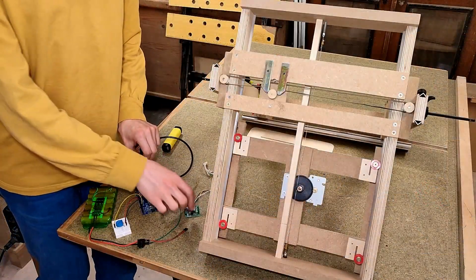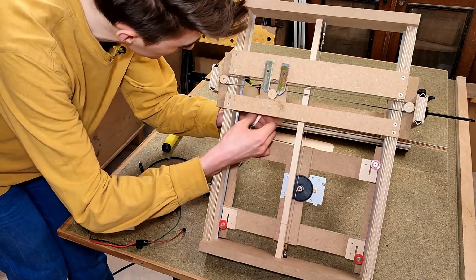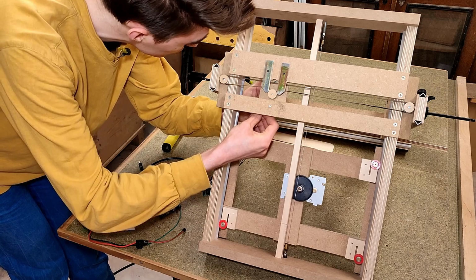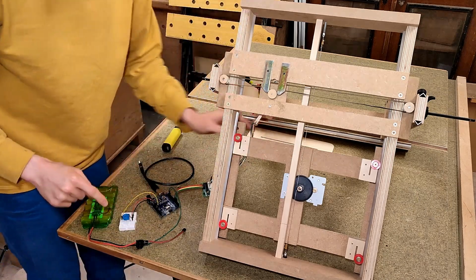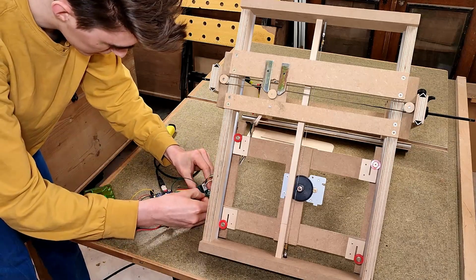Here I have an Arduino with a ULN2003 Darlington driver and a simple sketch, link will be in the description, to control unipolar stepper motors like this one, bidirectionally via a potentiometer. Here we go.